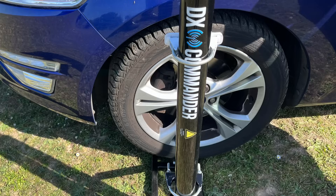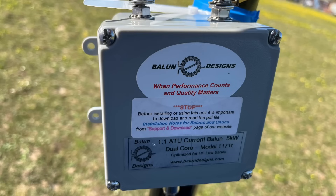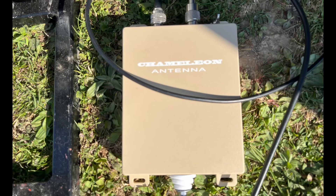For the heavy duty stuff, I used a 12.4 meter DX Commander pole fully extended, but I had the dipole at about the 10 and a half meter point from the ground. I also used a drive-on support to secure the mast for portable use. Then the ladder line came down to a one-to-one current balun — that was some Balun Designs — and finally from there the coax went into the Chameleon remote tuner.